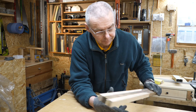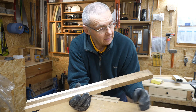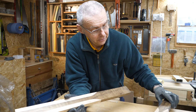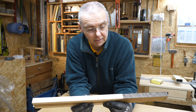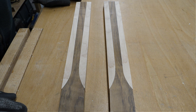That was rather fortuitous — I've not only ended up with one neck blank but also a second one which is 18mm deep, thick enough for another guitar. This is the one I'm going to use — it's just 22mm, I did it a little bit thicker in the end. What I'm going to do now is leave these to one side for a few days just to see what happens to the wood.